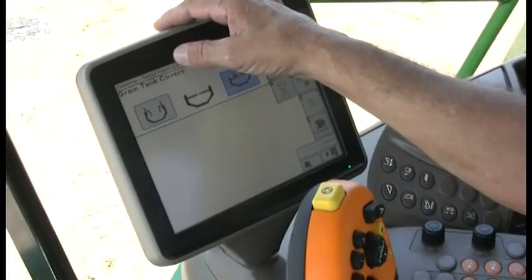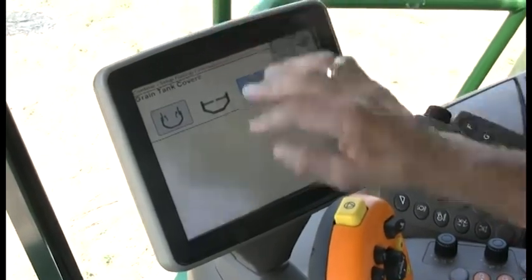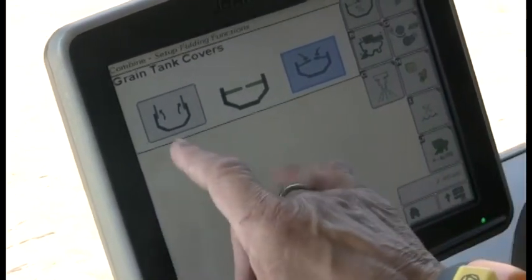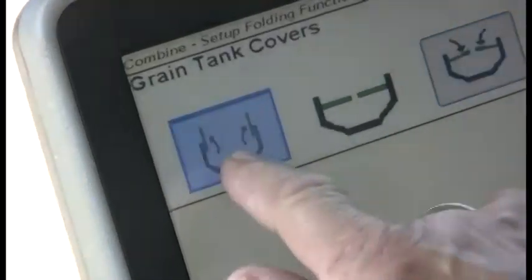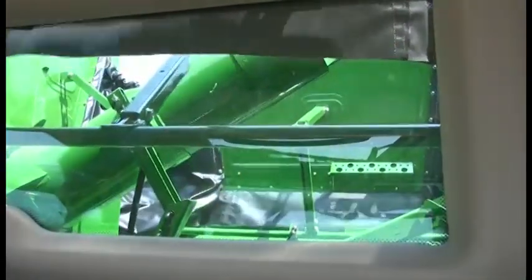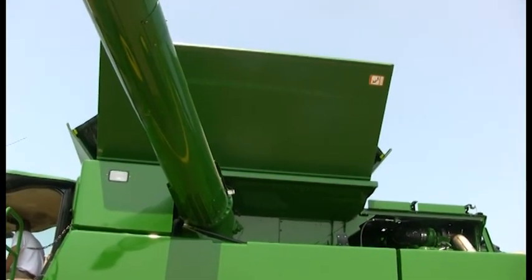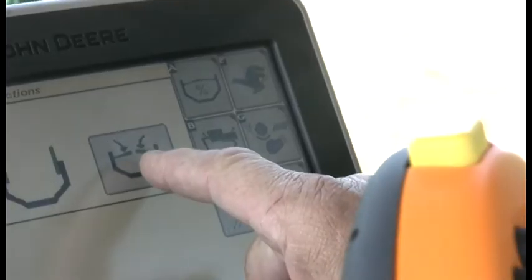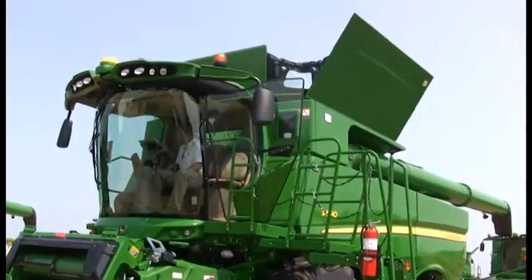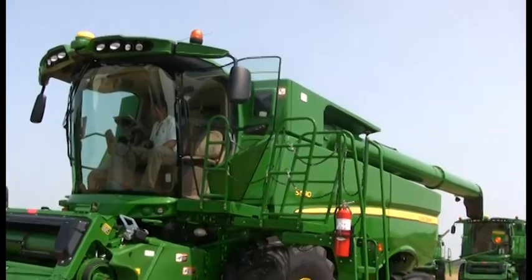Now let's talk about something I think a lot of people are excited about. In the past, perhaps several times a day you'd have to go up to the grain tank and either lower or raise the extensions manually. We now offer as an option folding grain tank extensions. As you can see on the touch set display, if I want to open them I press that button, and as you can see through the window in the back of the cab, in 30 seconds or less the extensions raise. Along with that, the fountain auger in the tank raises and the grain sample trough is put into place. When I want to close the extensions I simply go to the display, push the icon for closing, and it closes automatically. Note that the grain tank must be empty when you raise or lower the extensions.